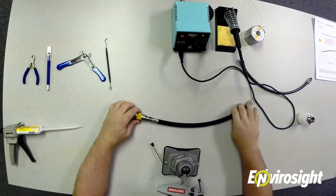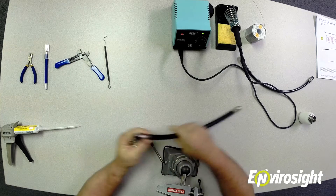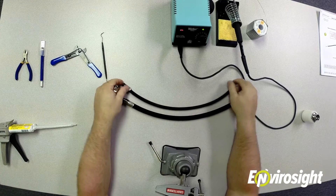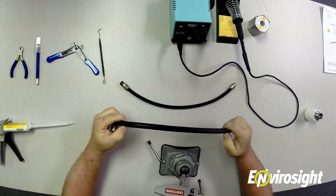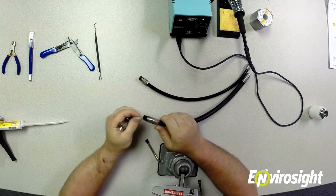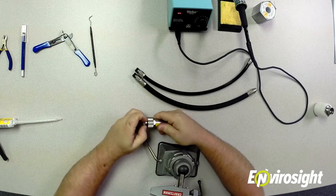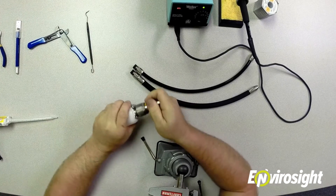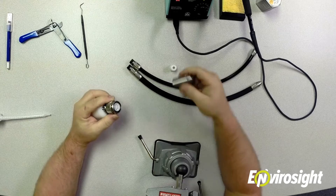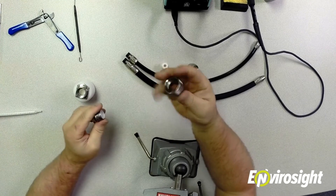The first step for doing the re-termination is to inspect your new piece. If you're replacing the entire connector, separate all the components to make sure everything is there. First you'll have your protection tube — there's an old-style protection tube as well, which is still available. As you can see, there's a difference in the diameter and material construction, so one is more heavy duty than the other, but they both work. Make sure the rubber grommets are in the end — without this it will not seal to the cable and you'll get water into the connector. Then you have the dummy plug, your back shell, and your solder cup for your strain relief, and your bayonet ring.